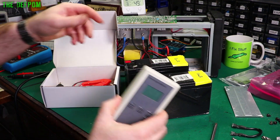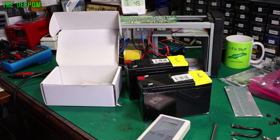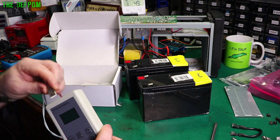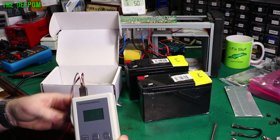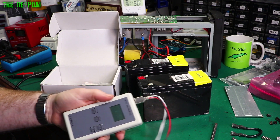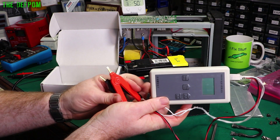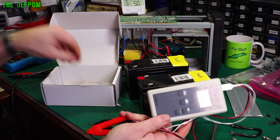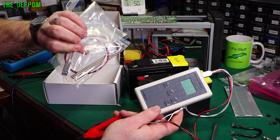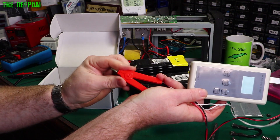One of the things I've got here is a little battery ESR tester — I did a video on it a few years ago. You can measure battery ESR to give you an idea of what the current-carrying capacities are of the battery. Because if you put a load on it and it's got a higher ESR, the voltage will just drop; if it's got a lower ESR, you won't. It comes with Kelvin clip leads and also pogo pin leads with a couple of spare pins. In this case I'm going to use the Kelvin clip leads.